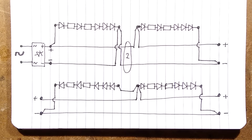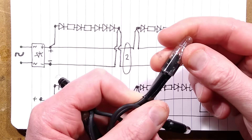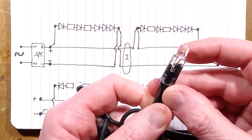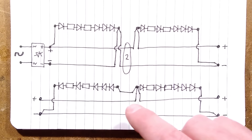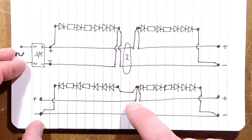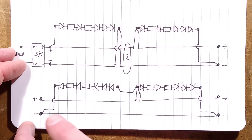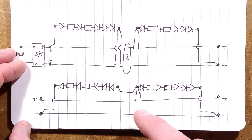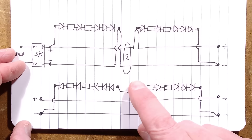Let me rifle through the LEDs until I find that one. Yeah, that's fairly congested — that must be a joy to solder and then stuff into the resin. Three of the wires are going to the positive and one is going to the negative to loop on to the next section of the string. The positive has run along and fed one section of lights, then that section too, then looped on. It may look like the negative can go all the way along one straight line, but with four sections it also has to duck in and out. It's the first time I've seen it done this way — it must make it more complex. At no point do you go down to two wires. Very strange — they must have had a good reason, but it seems like it would make it harder to manufacture.